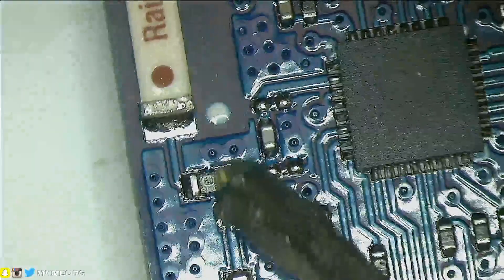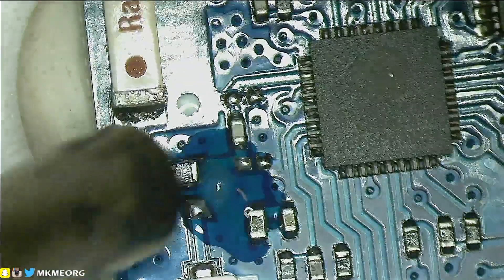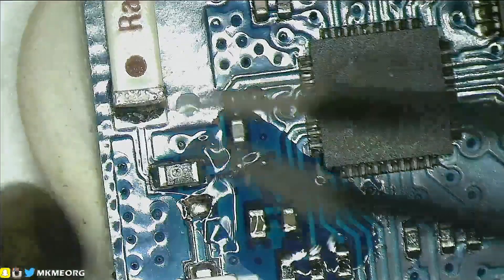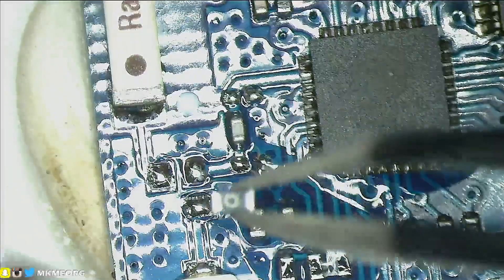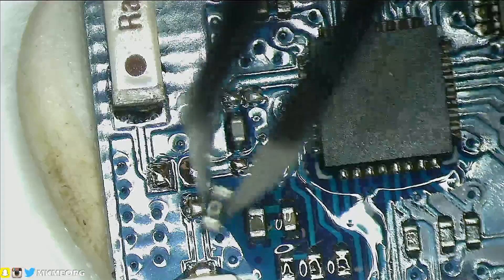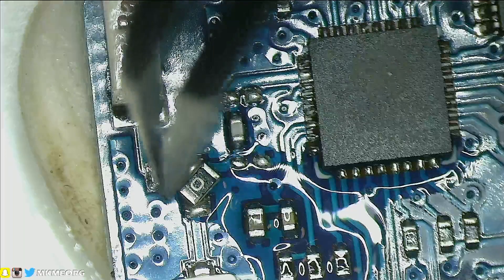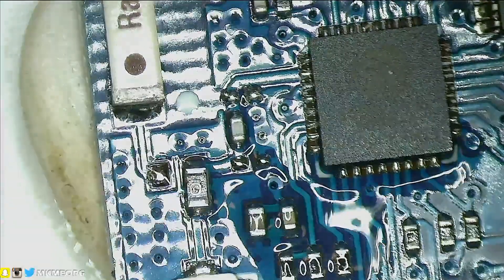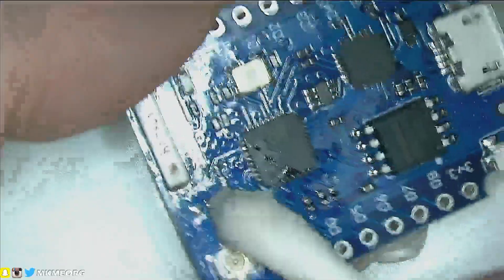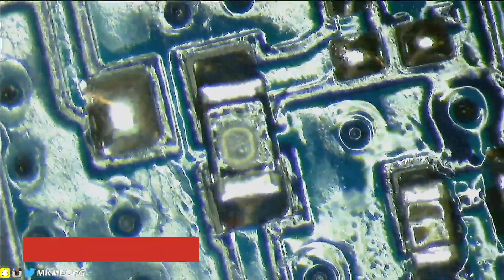To the modification I mentioned: this in the center of the screen is a zero-ohm resistor, just used as a shunt on the board. It currently shunts the connection through to the ceramic antenna. I'm using a hot air rework gun — you can use an iron on this just fine, but an air gun makes it much, much easier. I just warm it up, take the shunt resistor off, switch it around to the connection as seen here, reheat it, and let it flow into place. Just like that, you're done. A little bit of alcohol to clean up the flux off the board so it doesn't leave a sticky mess. And this is what you're left with — clean solder joints. Should work just wonderful.